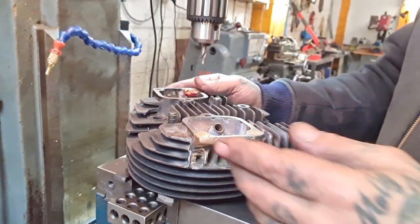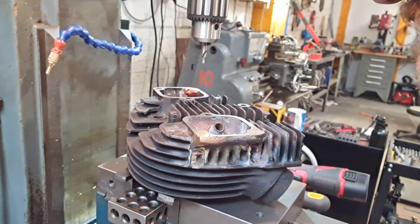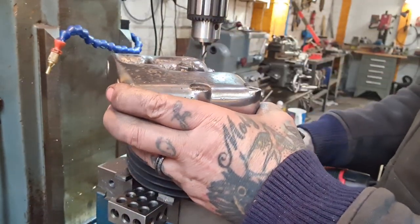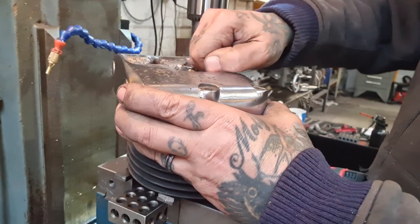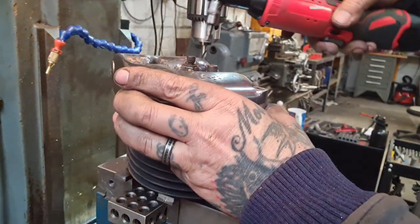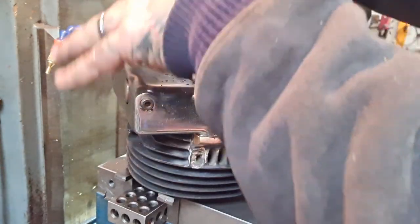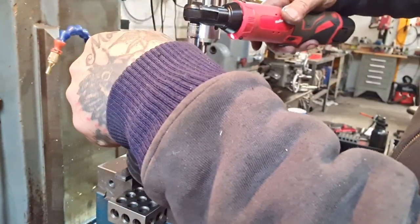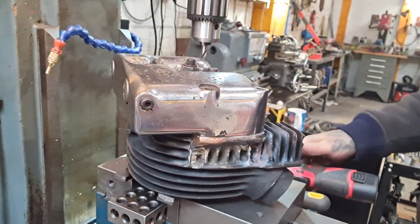Okay, so we've fly cut that and there's lots of material where I need it, so I think we're good. Here's the method. We're going to attach the rocker cover with the two centre bolts, thus. We know they're good. They're standard factory, they're our point of reference, right? Don't need to make it super tight. Just have them in. There we go. And where they need to be. So now that's fixed, yeah? Good. What we're going to do is